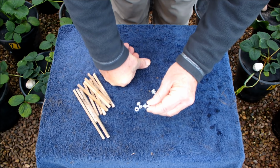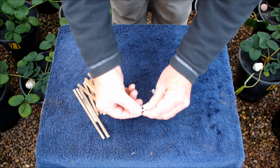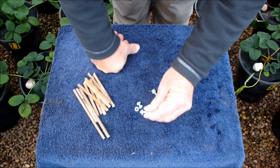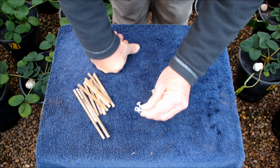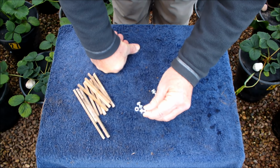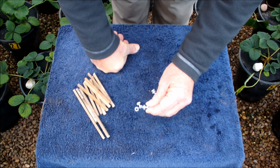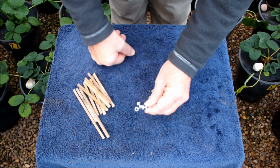You've over tightened it, but don't worry because you're slackening it. So what happens is it starts to slacken and then it binds up again and you can't get the nut off. No matter how hard you try, you cannot get that nut off. So, okay, we'll maybe have to live with this, we'll tighten it. But it now won't tighten either. It's got to a position where it's not tight and you can't get the nut off. Only thing you can do is get hold of the head and turn and turn and turn till you snap the bolt.